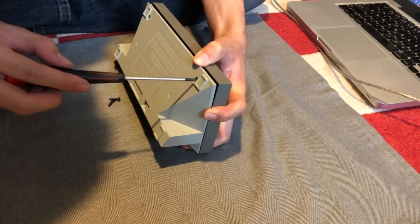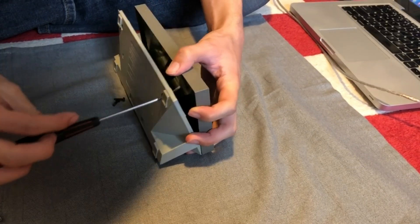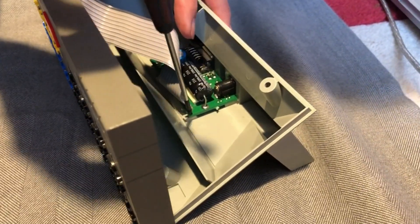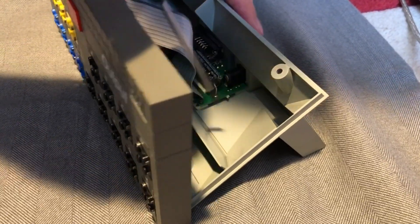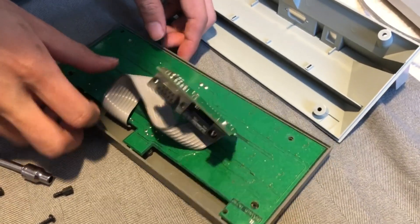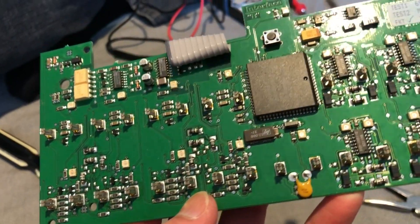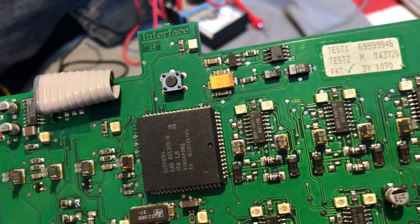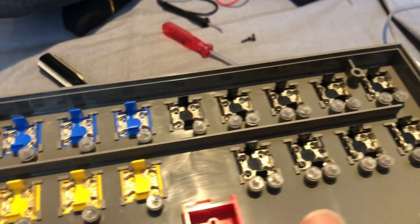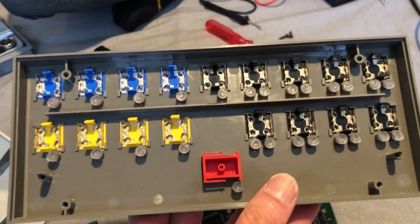We originally thought our unit didn't work and took it apart to inspect it. The two halves connect with four screws, but an internal ribbon cable joins them as well. To remove the daughterboard from the base, we need to extract the internal screws securing the board itself and the external standoffs securing the serial connector. The main PCB has tons of little metal prongs that clip onto the many connectors on the front panel — we saw this same feature in other 9V programmable bricks like the RCX and CodePilot, but never in such quantity.